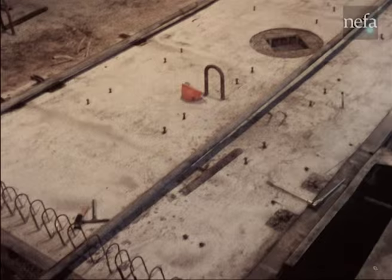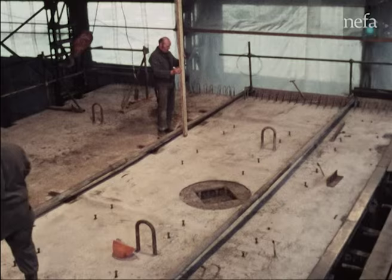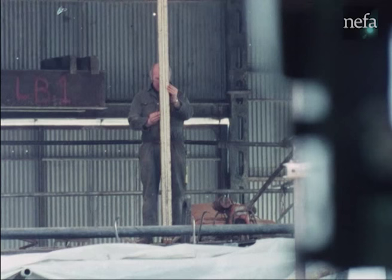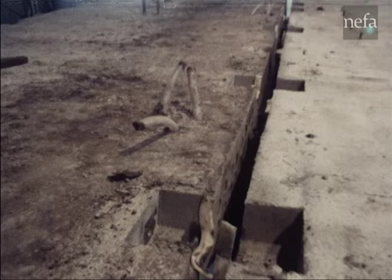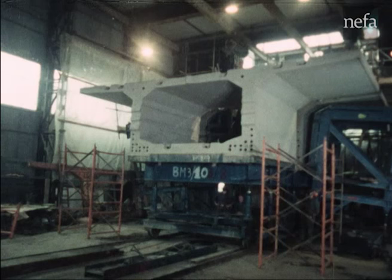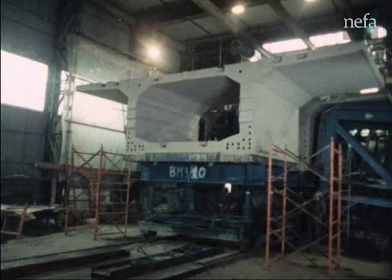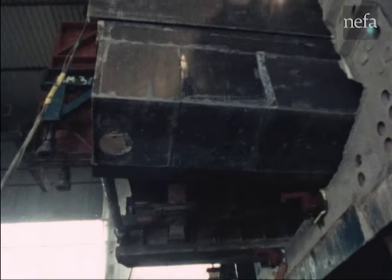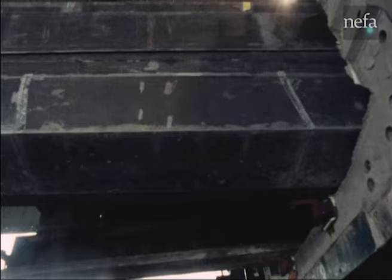The segments are counter-cast in the contractor's casting factory on site. Accuracy is the key. The concept, based on a series of glued joints, means that surfaces have to match perfectly. This is done by counter-casting each new segment against its predecessor, and at the same time the curve of the deck is created by the angle at each joint. The many operations involved have been carefully planned and coordinated to ensure the casting of a new segment every day.